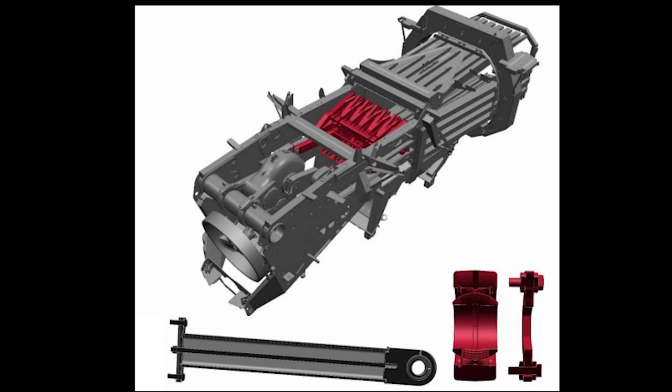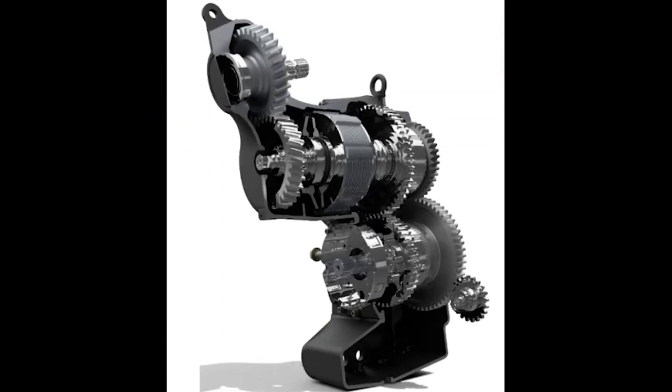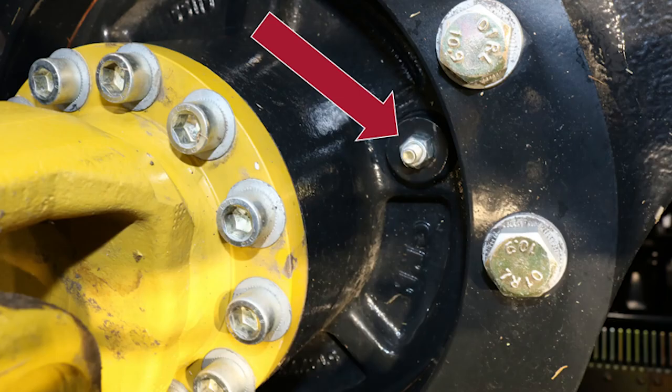The plunger crank arms are driven directly from the heavy duty gearbox, which in turn is driven from the power shift gearbox, in order to achieve the smoothest, quietest and most precise plunger stroke possible. Fully protected not only by the cutout clutch but also by two flywheel shear bolts as well.